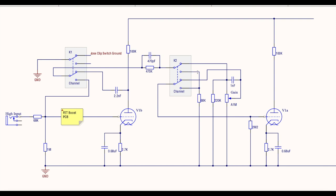If you connect this straight through with no gain pot or level pot on the clean channel, it's going to be too hot and your clean channel is going to be too distorted. So just dropping a 68k to ground there will get the signal low enough that you'll get the clean sound that I demoed. We only have one pot on this amp for the clean channel, and I decided to use it in the master volume position rather than in the preamp position. I played with both and I liked it better as a master volume.